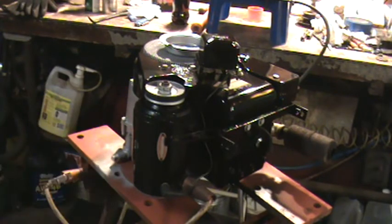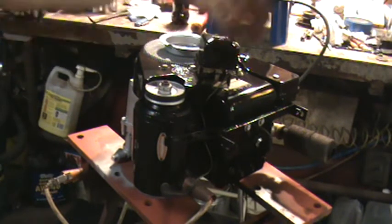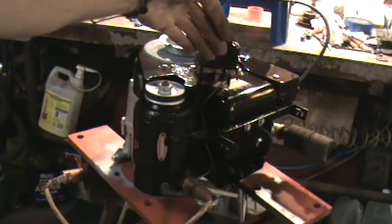But I may do it anyway just to clean the brushes and the commutator and show you guys all that kind of stuff to get one of these running again if they're not charging or starting for you. You've got two separate poles — the charging leg and the starting leg, which is on the backside in this particular instance.